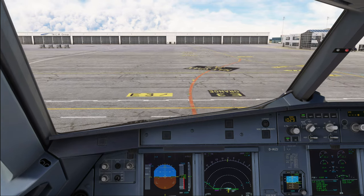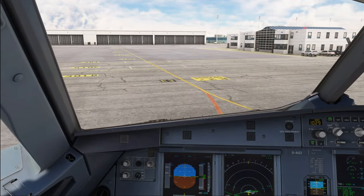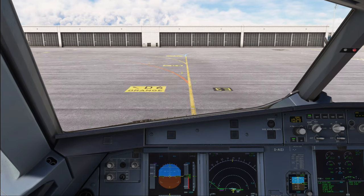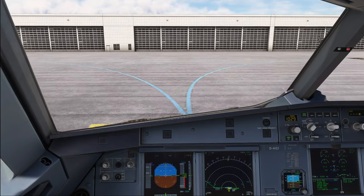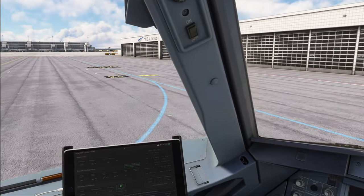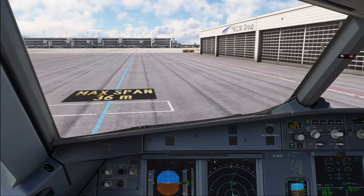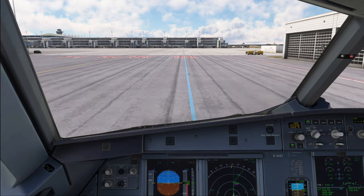The brakes on Airbus aircraft heat up rather quickly, so we want to minimize the amount of brake applications needed. As we are approaching a turn, we slow it down with a light brake pressure application, going below the speed limit to around 7 knots, so that even though the plane still accelerates on idle, we do not have to use the brakes again as we go through and complete the turn. If you only slow to 10 knots, you might have a 2-knot speed increase and need a second brake application — we do not want that. So do slow it down a little below the 10-knot speed limit in turns.